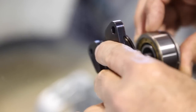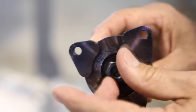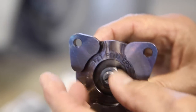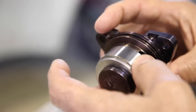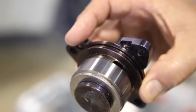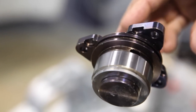This type of bearing will have five times the load-bearing capability compared to a ball bearing. Ball bearings do not compare in their ability to hold load like a cylindrical roller, and that's why we are using this bearing for the problematic IMS solution to the Boxster and the 996 engine.